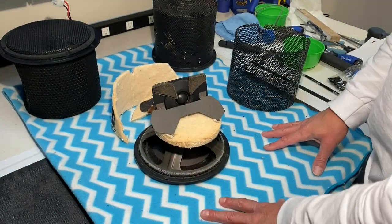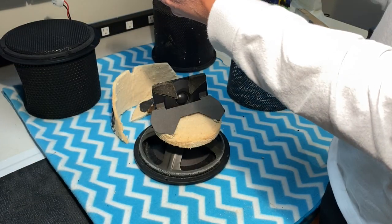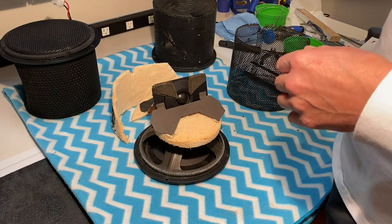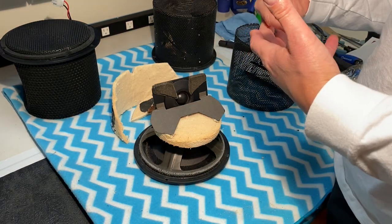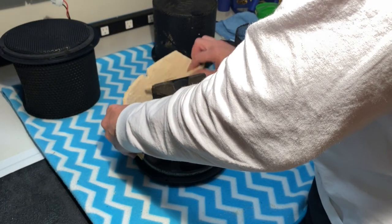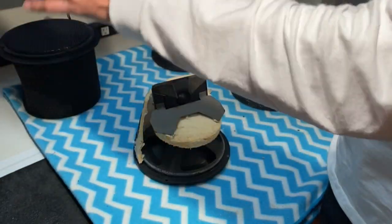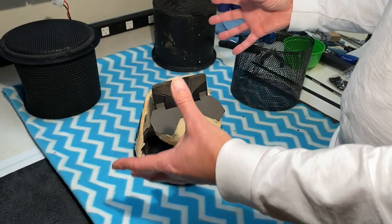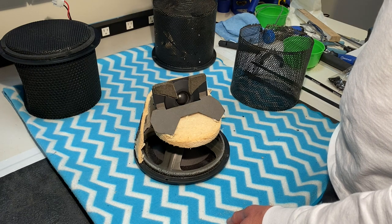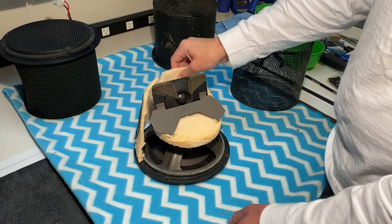Sometimes when speakers are too omnidirectional and they're bouncing sound all over the place, you get a lot of strange reflections and sound delays, and you start really hearing the reflections from the back of the room, which can really color the sound that you hear from the listening position. So Ohm wisely tried to pick a balance, and I think it works quite well with their designs. You're getting a little bit of the reflections from this somewhat omnidirectional arrangement, but the rear output is highly reduced, so you're only getting a flavor of it, it's not competing with the front output, and it works really quite well.